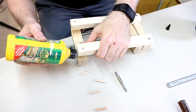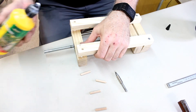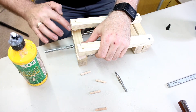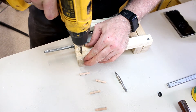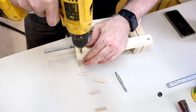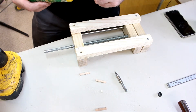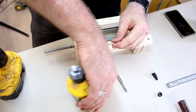I'm now going to proceed to glue on the head, which houses the 10mm threaded bar with the two nuts that I've glued in with two-part epoxy. I'm now going to drill out 6mm holes to insert dowels to hold the head jaw.